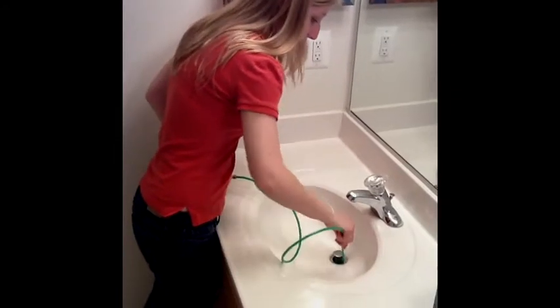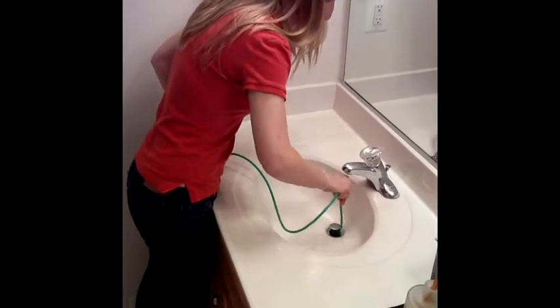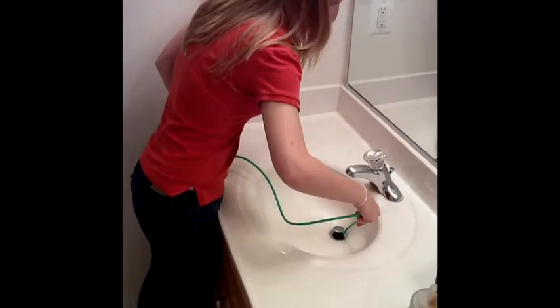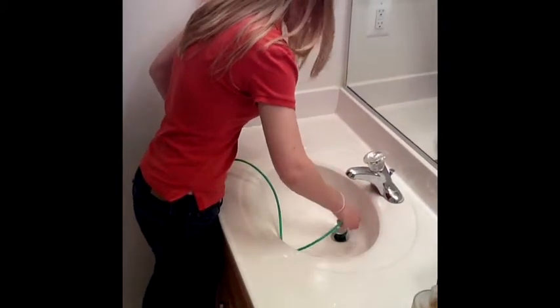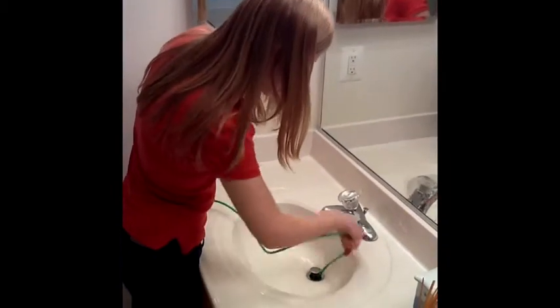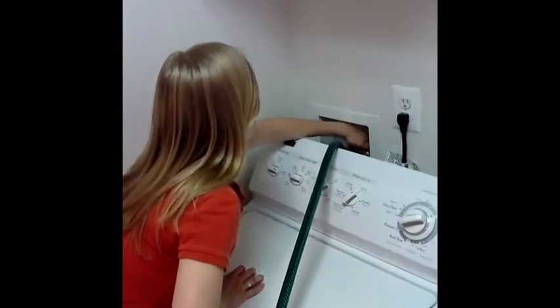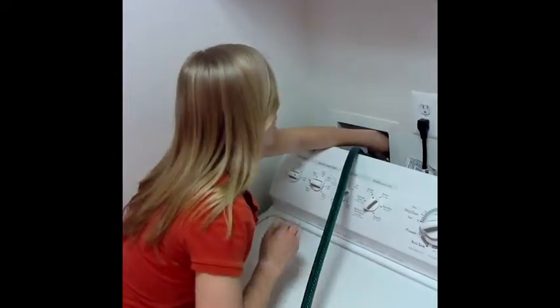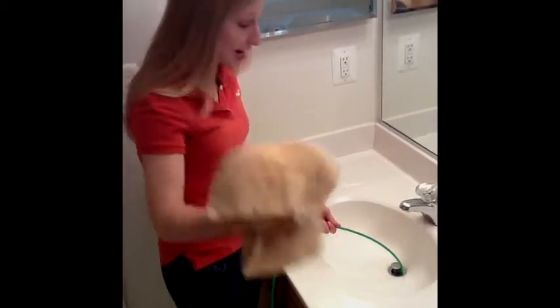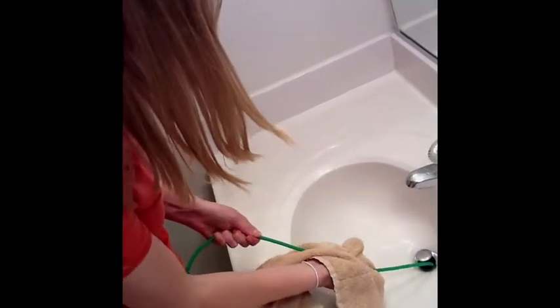Angle it on different sides. Make sure it goes all the way down until you feel it's necessary. Once the drain is unplugged, before you take the jet out, make sure you turn your water back off. You should hear the stopping of the flow of water. Keep that same towel handy. Pull the jet out — you're going to see some debris on the jet, which is normal. It's all the stuff that was clogging your drain, so just use that handy towel to get it all off.